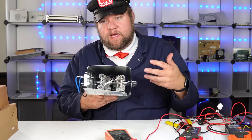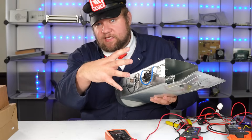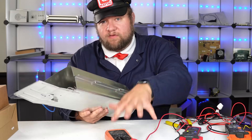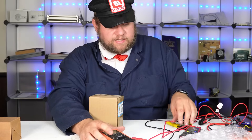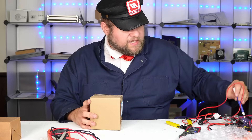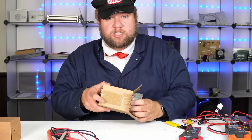If you just went in and replaced the sensors when you needed to replace the element and vice versa - people will buy the heating element when it's just the sensors. Sensors may be around $25 whereas the whole heater canister could be $70 to $150 OEM. It's not about making you pay more for a multimeter - it will end up saving you a lot of money. Now let's go to something else - those were tests for continuity with and without the alarm. The other thing to look out for is resistance. On something like a motor, not only do you need continuity, it needs a certain resistance telling you the coil is wound properly - if it's too high or too low it's considered out of spec.